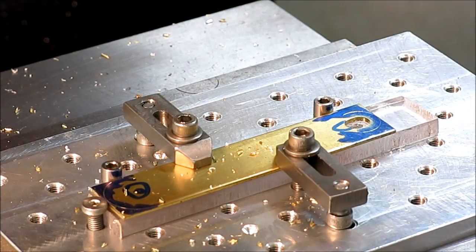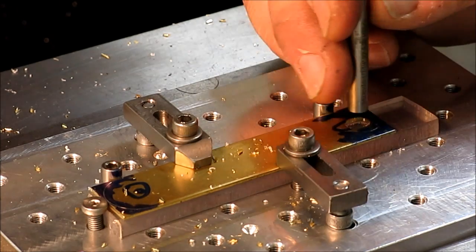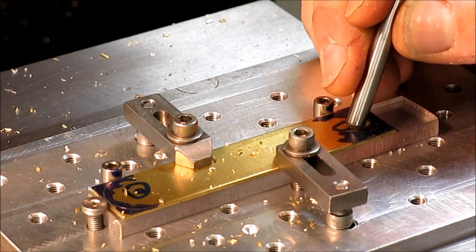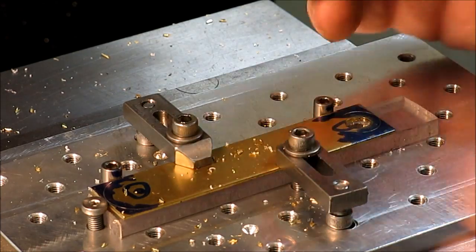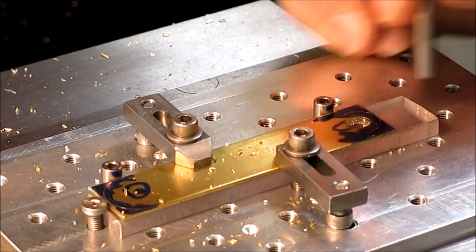Before I get out of there, I'm going to just put a plug gauge in there and see. Have anything handy? Here we go. That's 1/4 inch. Looks like it's a little tight. Let's measure that. Make sure that's kosher. Yeah. All right. Maybe that end mill's a little under. Well, I want it to fit the screw pretty good, so let's see.